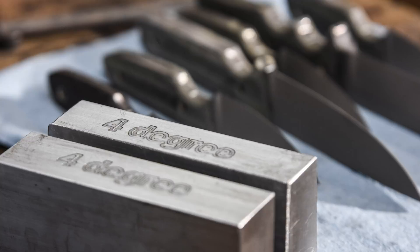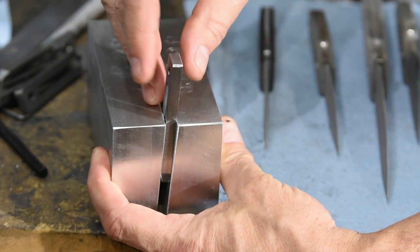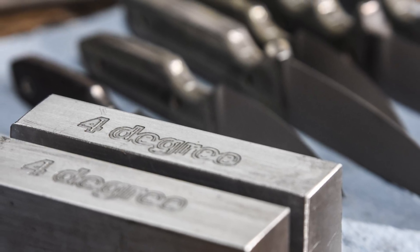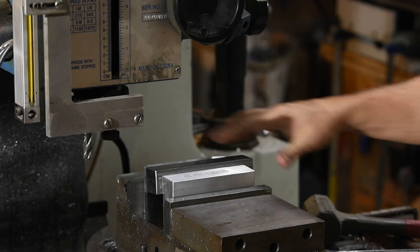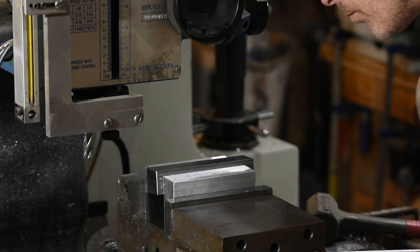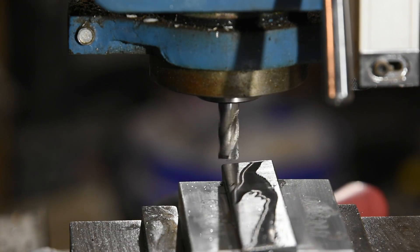For other projects, I've made several pairs of vice blocks that allow me to hold work in my milling vice at preset angles. In this case, I'm looking for a four-degree jig, and I happen to have some four-degree blocks. So using a parallel to gain some clearance, I'll tighten up the piece of stock in the vice. It's just a simple matter of milling in a flat for the blade to rest on.